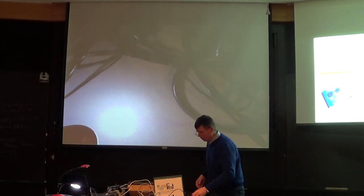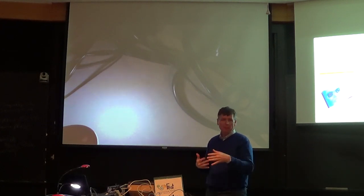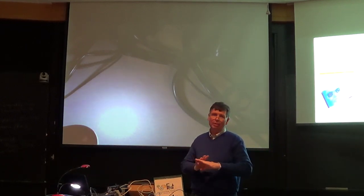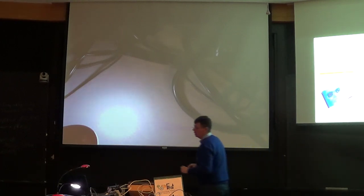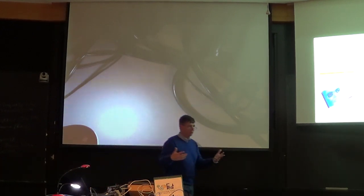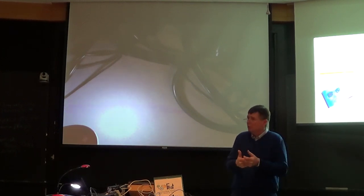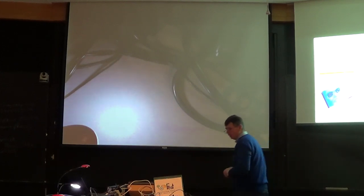By the way, as it's booting up, you'll see a little LED on it that shows the SD card activity, so it automatically boots off the SD. The reason I have these configured with the SD card is that the onboard flash isn't big enough for things like Python, OpenCV, and SSH servers, which are pretty useful. Beyond that, once you get the SD card, you have storage, and since it also has USB connectors, you could literally connect large-scale storage devices as well. So there's no reason you couldn't use the Galileo for media, entertainment, servers, a lot of different things.